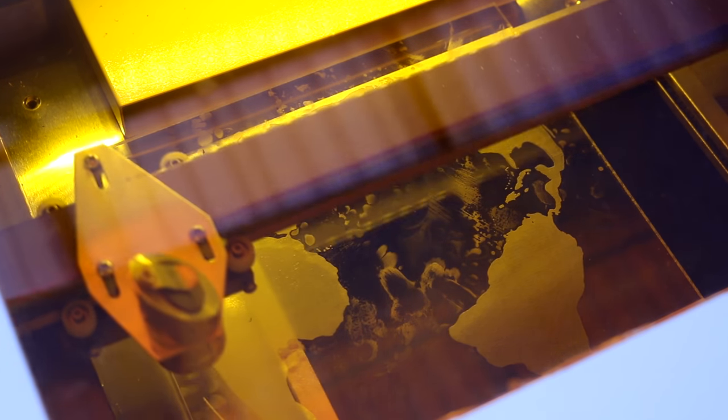To keep the exterior of the perspex smooth, I opt to mirror the image and etch the inside of the perspex — this way the image looks correct when viewed from the other side. I also etched points for where to drill holes later. After the etching is done it's just the case of getting the laser to cut out the perspex. The back piece is cut exactly the same, just without any decorative etching.